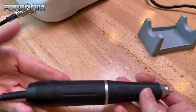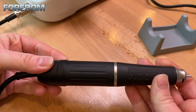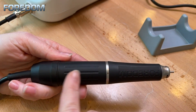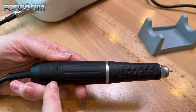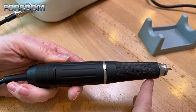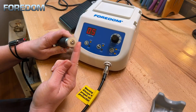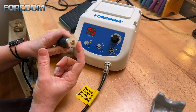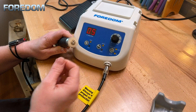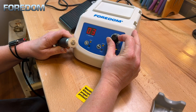The handpiece is more than just a handpiece — it is the motor itself. This is a brushless machine, which means the handpiece is sealed with lubricated steel bearings, and that means less maintenance for you. The thing that makes this machine so special is that you can start it slow and it has full torque right from the get-go. Maximum torque is 11.3 ounces or 8 newton centimeters, which is about 160 watts output. That means it can handle heavy jobs even at lower speeds.